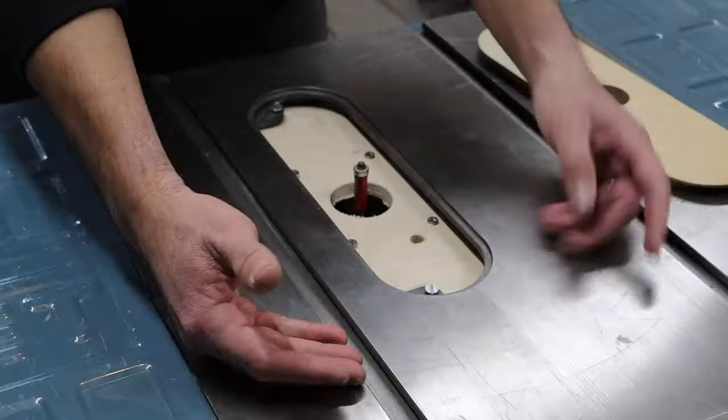I put a two inch hole in the mounting plate, then put a nine sixteenths inch hole in the insert plate here. I can probably make more of these with different sizes, but this one will fit all of my current router bits. On this plate I put a few coats of an oil-based finish just to give it a nice smooth coat.